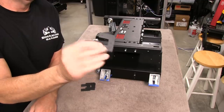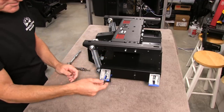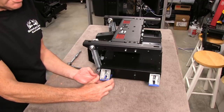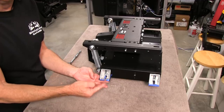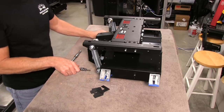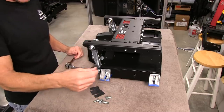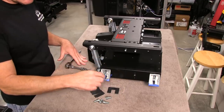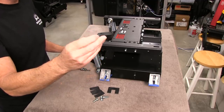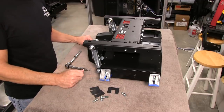I'm going to be using these spacers — spacer material that comes in long fork-shaped pieces you can snap off. I've actually trimmed these down to size so they'll sit underneath and I'll have the bolt down in the middle, and they won't be sticking out past the bracket once it's sitting on top of the profiles. Now all we've got to do is take this heavy piece of kit — 55 pounds of it — and very carefully place it on these pieces. We'll be securing it with M8 galvanized socket head cap bolts, about 15mm long, just enough to go through and grab the nut already sitting in the profile.